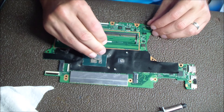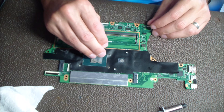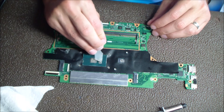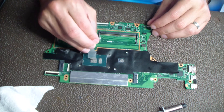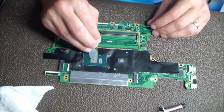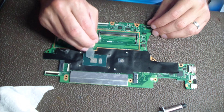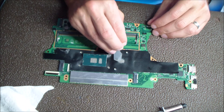You'll see in the picture below what it looks like when it's all done — kind of a close-up. I'm just trying to flatten out that thermal paste so it makes good contact with the heat sink, and try to remove any air bubbles. That's one of the main goals — just to get that stuff flattened and nice and even on the die. Obviously you have to do this for each die: the Core i7 that I'm doing it on and then the NVIDIA GPU next to it.